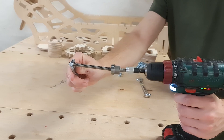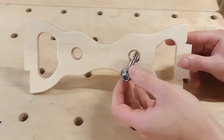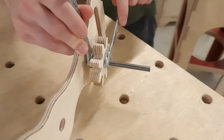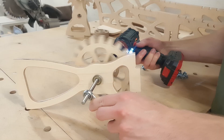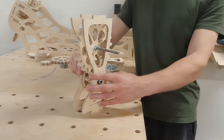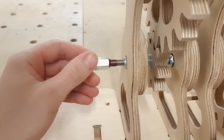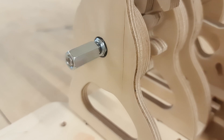I knew the gear ratios would work, however I'm not too sure about the axis. For this assembly, I'm using an M8 stainless steel rod to which I will attach the ball bearings and the gears. The bearings are secured in place with plywood components, which also aligns the threaded rod axis properly. In the middle of the first axis, we have attached a smaller size gear which will transfer the power to the larger size gear on the second axis, reducing the necessary input power by a factor of 2.75. At the end of the second axis, we are attaching another smaller size gear which would connect to the larger gear at the wheel axis, again reducing the input power necessary. I glued an extended nut to the power axis using high-strength threaded glue to join the gear mechanism to the cordless drill.